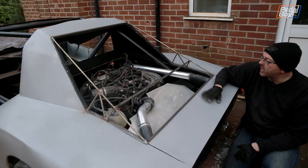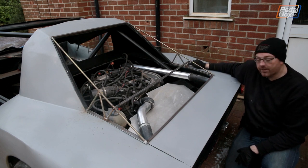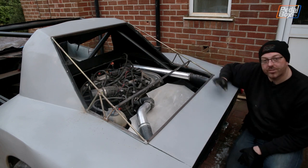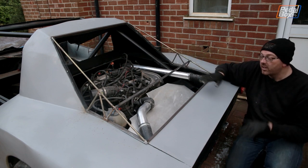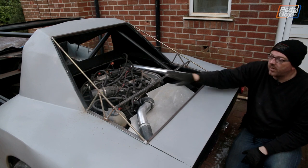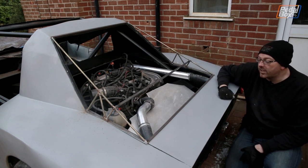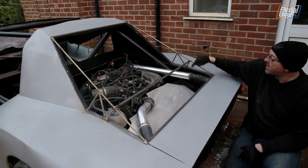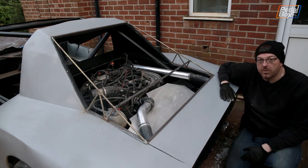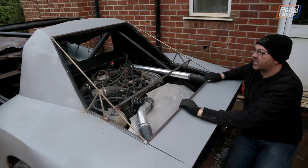I took another look at the angle coming out from the rear window and decided this is a much better location for this to come down. It's still 90 degrees off where the brace is, but instead of being in the very inside corner it's now on the very top apex of the rear wing, coming up at 90 degrees from the rake off the back window and bracing across there. The reason is that when I was measuring before, the car is actually still on a rake with the front end lifted up, so the window would have been much higher than ideal. I've lowered this down and now it's much flatter — even a little bit dropped — which is a much better location, and it's still nicely triangulated along the side. It still needs a few more braces putting in from about a third of the way in from each side into the centre.